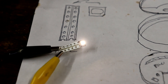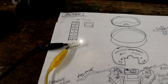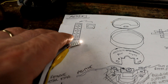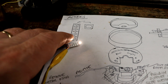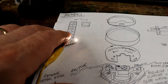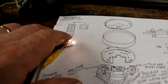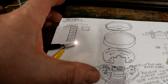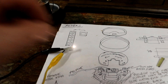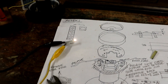So useful. The great thing about these little LEDs is they've got 180 degrees spread, whereas — because it took ages to work out how to do this — I experimented with all sorts of other standard 3mm and 5mm LEDs, even ones with conical lenses on the front. But none of them came nearly close to these ones with the ability to illuminate everything in front. They'd all produce a sort of beam-type thing. Right, let's get them fixed into the slots.